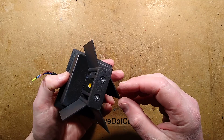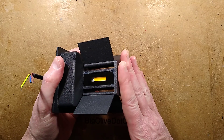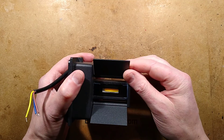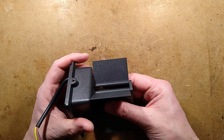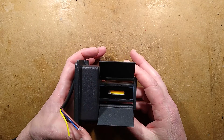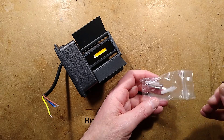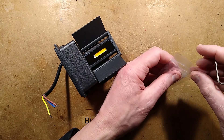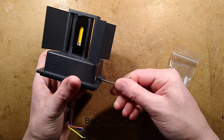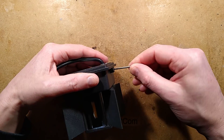Unusual to see COBs like this — that is a five watt COB, which is quite a lot of power. I don't see much in the way of thermal management. I suppose the whole thing's made of aluminium, so the barn doors will have some effect dissipating heat, but I don't see a fin dissipator. It's going to rely on the bulk of the aluminium and air flowing through the light to keep that cool. It does come with fixings and an Allen key, which almost invariably means the fitting is going to be held on by little hidden screws at the side, covered by the fitting when it's all installed.